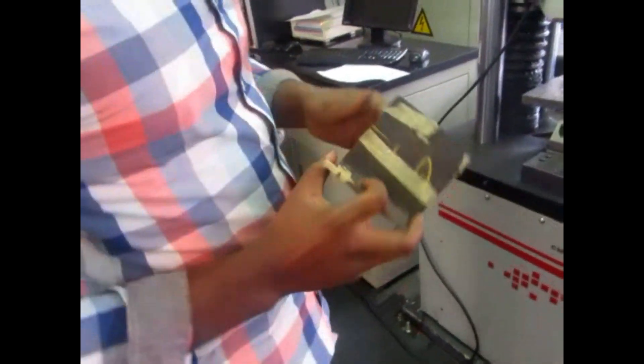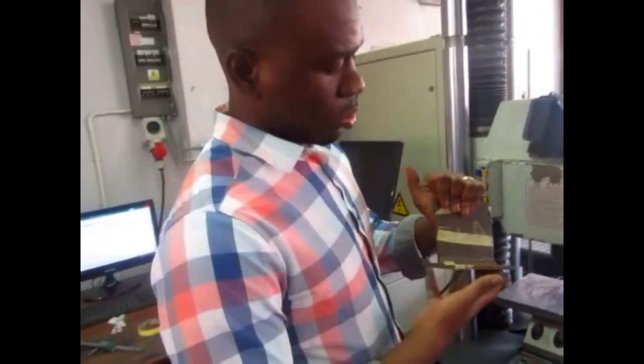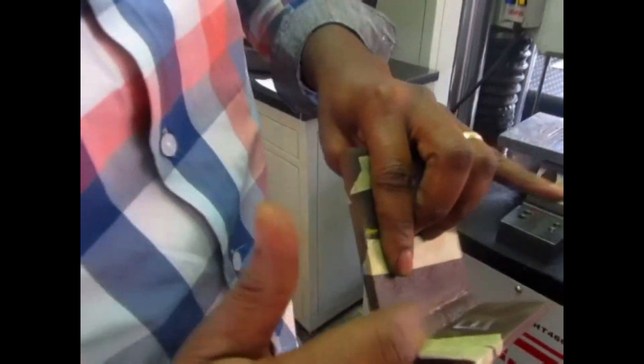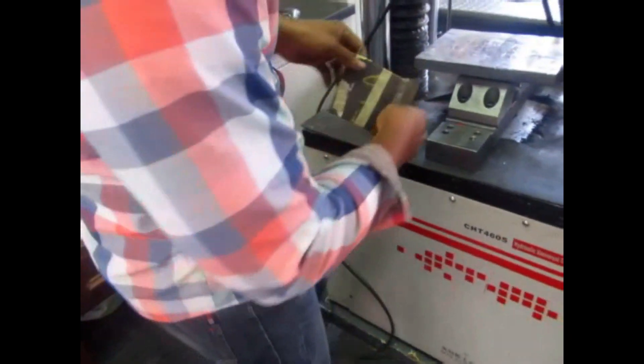As I said, fracture testing is to some extent an alternative for macro tests. My plan here is to try to put pressure on the side so that I can open the root of my sample. I'd like to see how well the weld fuses with the parent metal.